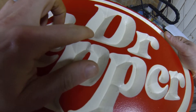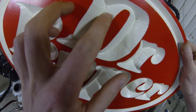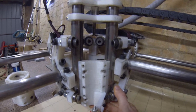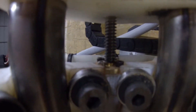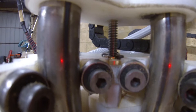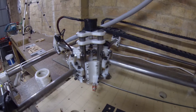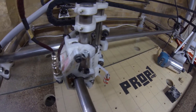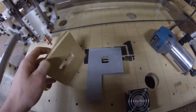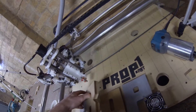About the only gripe I've got with the mostly printed CNC is the artifacts you can see in these carvings. I suspect them to be coming from backlash in the Z axis, as it seems consistent with the amount of play on the lead screw. When I get around to it I might end up putting a ball screw in, but for now I'm pretty happy — under $250 really can't go wrong. It's definitely as accurate as about a quarter of a millimeter, the same as a 3D printer.